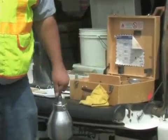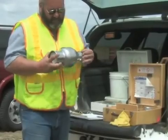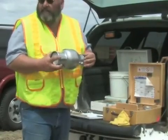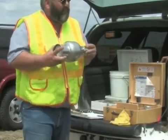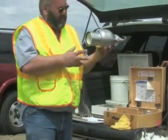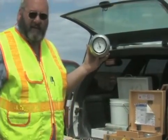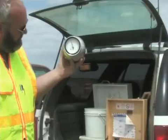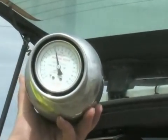Shake with a rotating motion to put the steel balls into orbit around the inside circumference of the tester. Rotate the speedy moisture tester for 10 seconds and rest for 20 seconds. The shaking and resting process allows the reagent to react to the moisture in the soil. This process mixes the soil and reagent together and breaks the soil down and completely dries the soil sample.